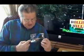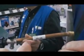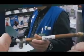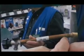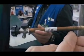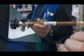It may look something like this on the outside of your home. This is what the faucet looks like outside — what you actually see right here. But if you could see what is actually there, this goes all the way back underneath your home. When you turn this valve off, there's a small line that goes through here and it actually shuts off in the back, not in the front. When it shuts off back there, the water that's in that line runs out and down and out of the pipe so that it doesn't freeze.